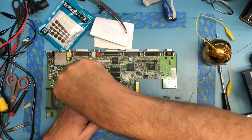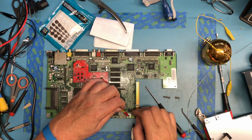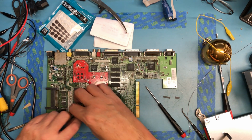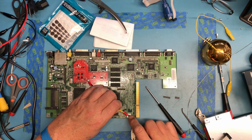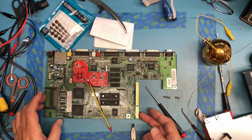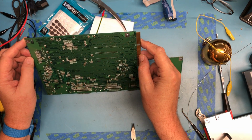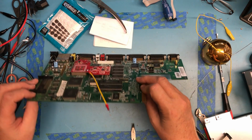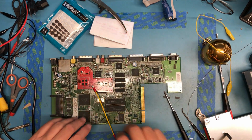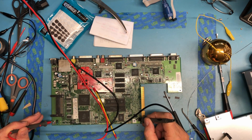Nice electrical connection. I would recommend putting that on first. And my assumption is this lead's meant to run over to here. Really, it looks to me like it's meant to run over to this ground pour right here, just I'm assuming that's a ground pour. Looks rather isolated, actually, so maybe it isn't. We will find out. Nope. It's a ground over here.